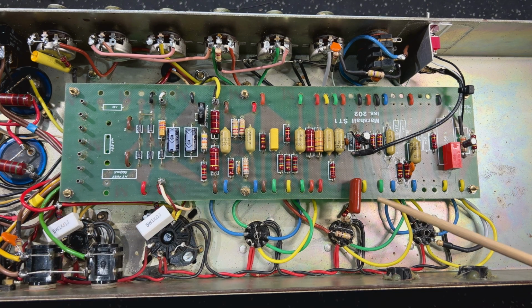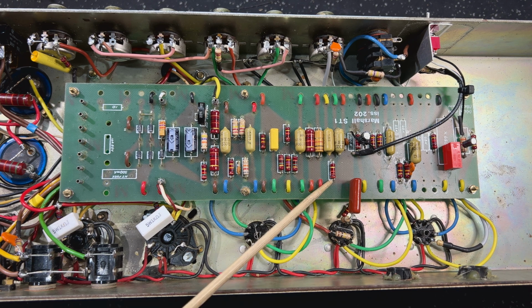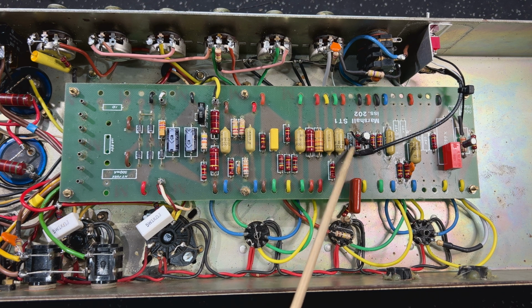So this arrangement down here, guys, we've talked about this a lot on the channel before. This is where we interrupt the link between the top of the 100k resistor on the cathode follower and the tone stack. Now, in a normal setup on a Marshall, that 100k cathode resistor is normally on the board right here, so I have to take that out. And you can see with the copper on this PCB that it connects directly to the top of this 33k slope resistor. This is part of the tone stack, the treble, middle, and bass caps.